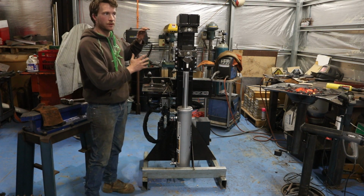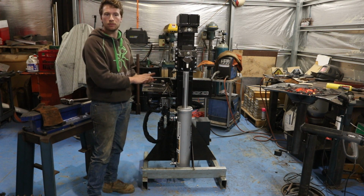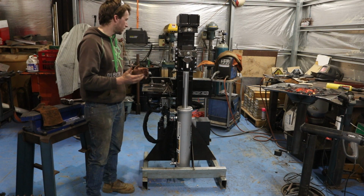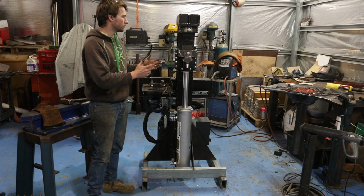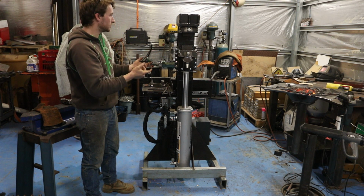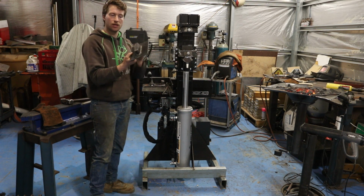If you're not aware, most of it comes from a Black Diamond 40-ton log splitter. We've made a kit to make it upright, put an electric motor on it, and basically sort out the forging side of things. This is working really well. We've made up a bunch of quick change dies.